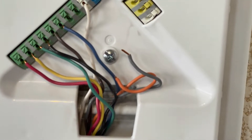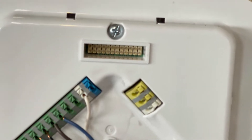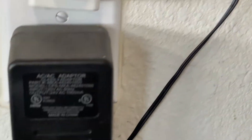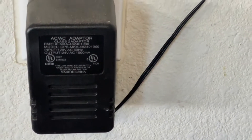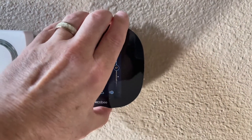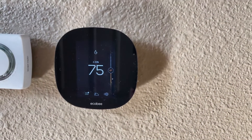This is the same kind of wiring that comes from your irrigation system into your irrigation control system. You'll notice it's all low voltage wiring, but at the top there's a larger electrical part — a transformer that connects to 110, your normal power source, and steps it down. You'll find the same kind of low voltage wiring inside your light switch that turns on your fireplace, as well as the wiring in your thermostat that turns on your heating and cooling.